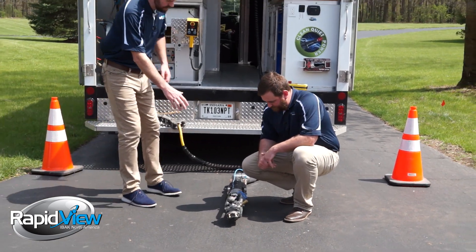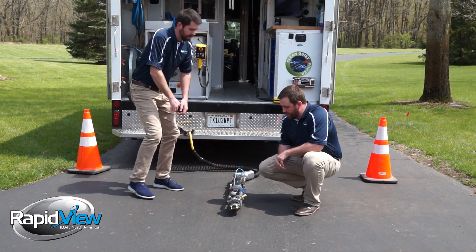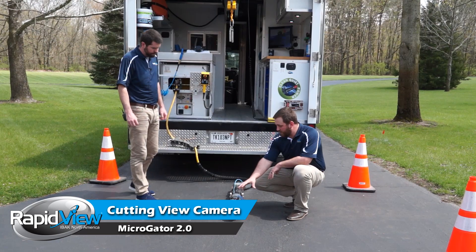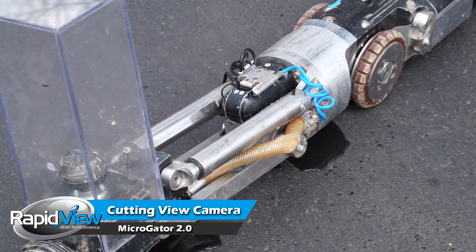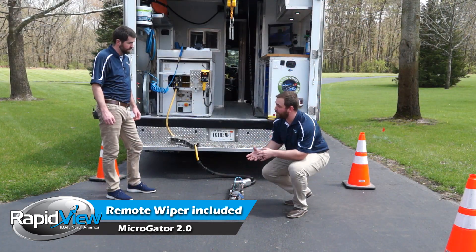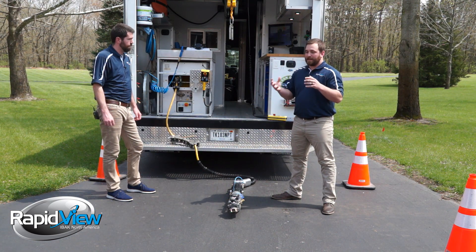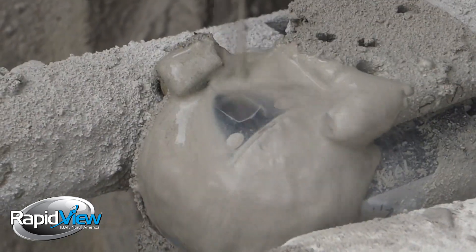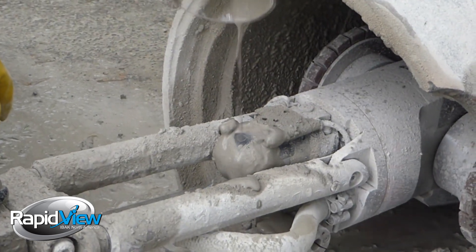As far as the camera back here, is this to help view our bit up front during the cutting process? This camera is for your cutting view — you can view the bit there. A couple special things about this camera: you have the ability to rotate it backwards and clean that lens with water and a wiper. We also have an air curtain on this camera. When you're cutting, you get a lot of debris flying around in the pipe that can obstruct your camera lens. The air curtain and the water work together to keep the camera clean.